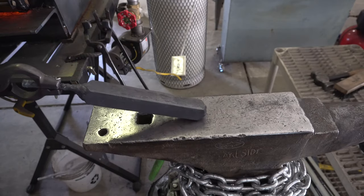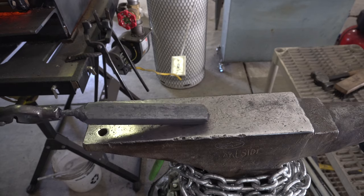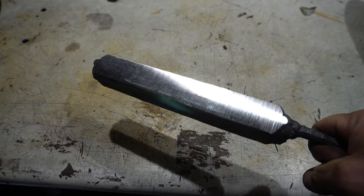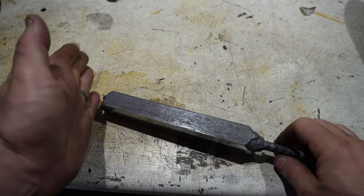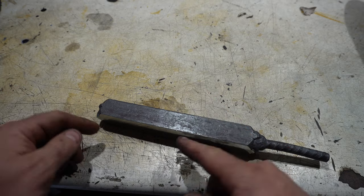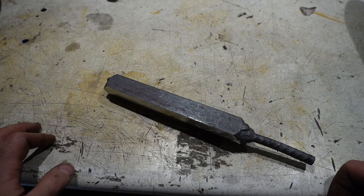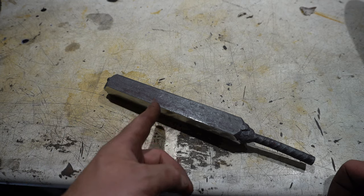Here it is after forging the mosaic — it looks really good. Now I've got to slice it up and tile it and then we'll get our pattern. Here it is after it's cooled down. I've ground opposite sides because I'm going to cut it on angles like this for the tiles — these faces are the ones that are going to meet up. I'm going to do this on the bandsaw so we don't lose as much material.